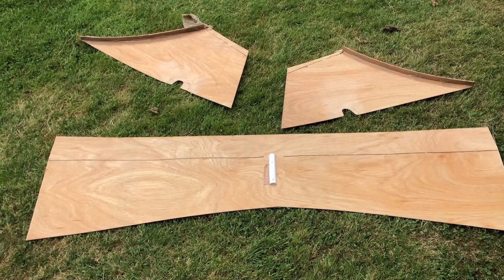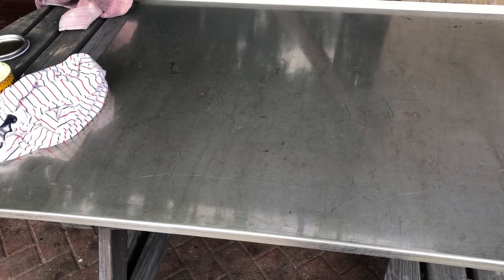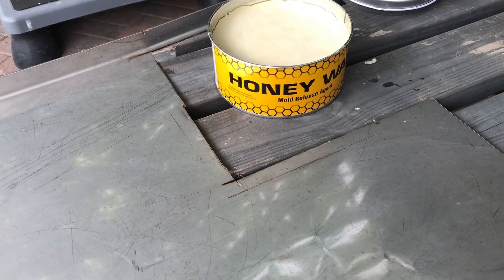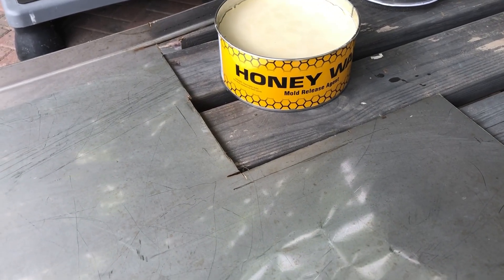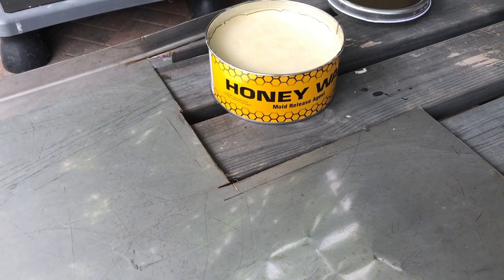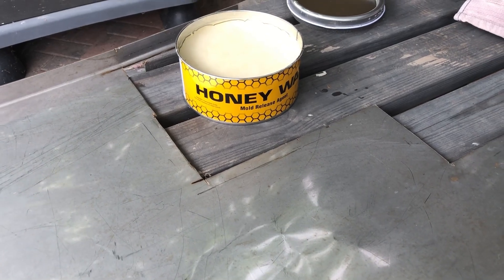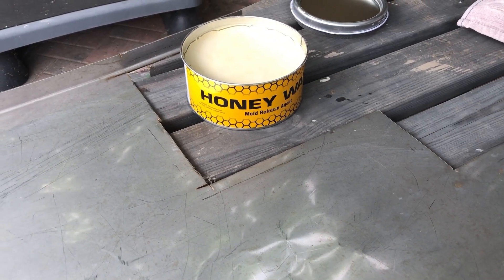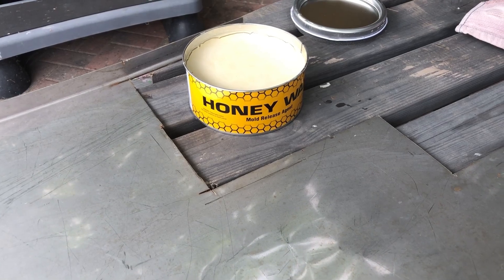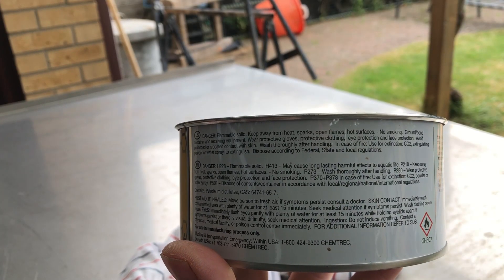What I'm going to do is form these shapes in fiberglass the old cheating way. I've got a sheet of stainless steel — I cut the middle out — I'll put it on the table and use honey wax mold release agent. I'll get this bit of stainless all covered in wax, keep buffing between coats, and I'm going to lay it on the stainless — just one sheet of mat — and then cut up the shape.